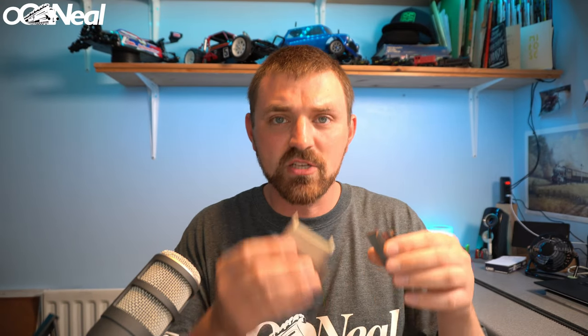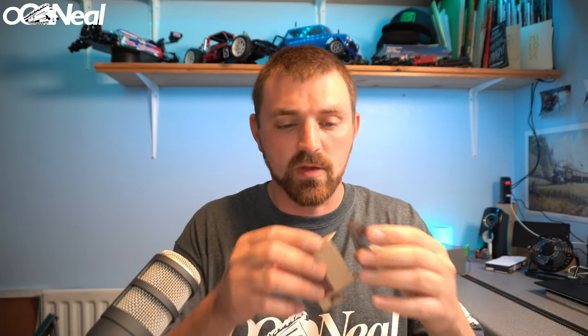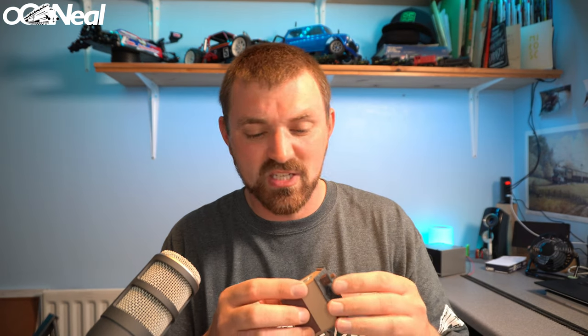The first part of it, when I started making it, I've got a roof over here somewhere. I put it down, I can't find it. The first one I had didn't go to plan. Maybe I threw it away. I think I threw it away. I'm still looking. What I find is when I print with the resin printer, I get the issue where it's always a bit oversized and other bits are undersized, so when you want to put it together, it doesn't fit. So I ended up having to make this bit quite a lot bigger, and actually used the slicer software and just made it 1% bigger, and it was enough that it then fitted together really nicely. So that was that.